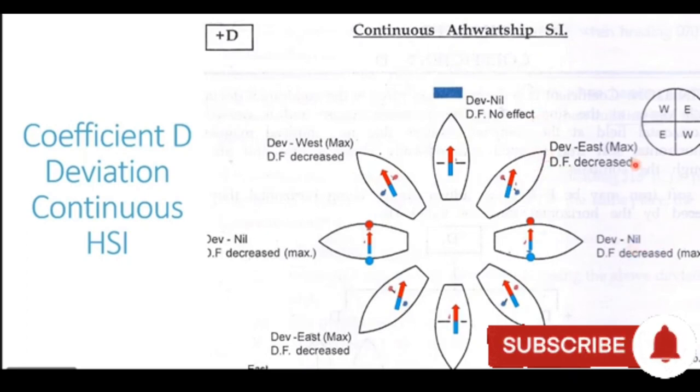So why is this decreased? This is decreased because the blue end of the beam is aligned south of the compass needle, where we have the red end of the earth. Since the pole of the beam is opposite in direction, or opposite in polarity, to the pole of the earth, it reduces the directive force.